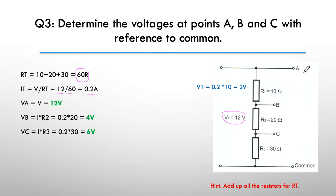The voltage at A is reasonably straightforward — because they told us there was 12 volts applied, there must be 12 volts at A. Next thing I worked out was the voltage drop across V2 for point B, and we worked out there is 4 volts across that resistor. And at VC there is 6 volts across this resistor.